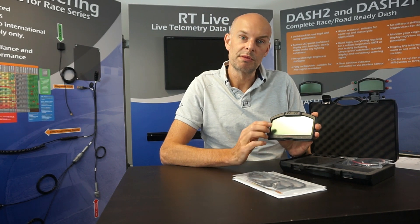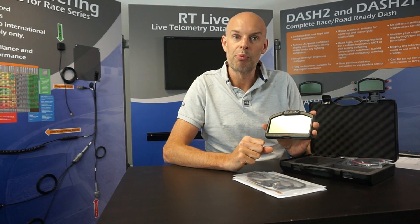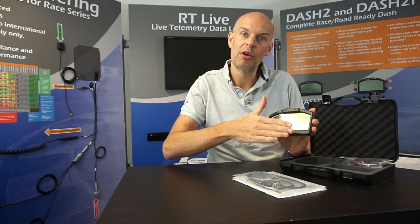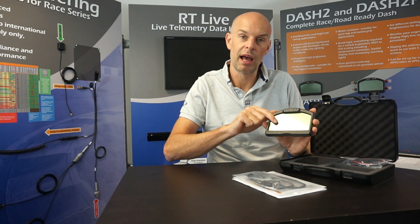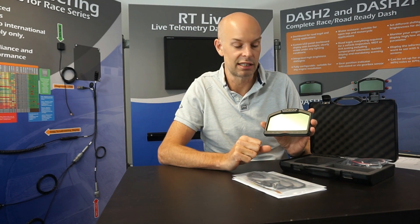At night time it's backlit — there's a backlight that covers the whole area so you can see it in complete darkness. When it's very bright and the sun hits the screen, it has a half-mirrored backing to the display, so the light is reflected back out past the LCD, meaning the display can't wash out. That's very different to how your mobile phone works, which is only ever backlit — so the more sunlight that hits the screen the more difficult it is to see. It really is very nice and clear under any lighting conditions.